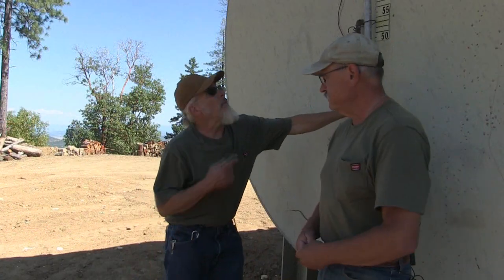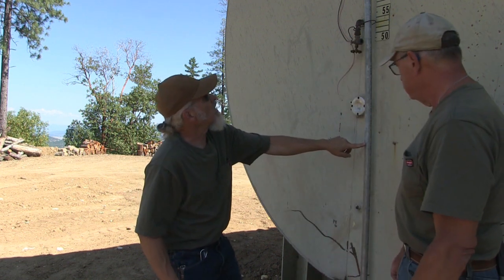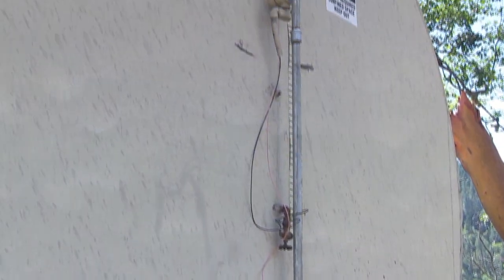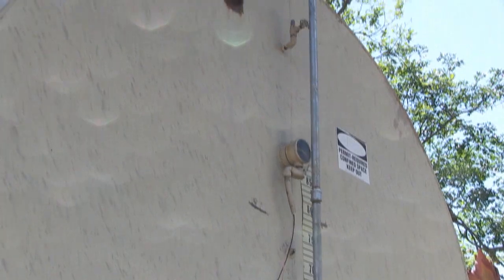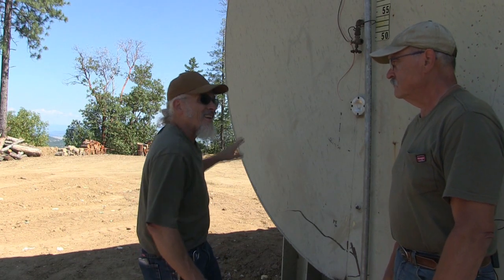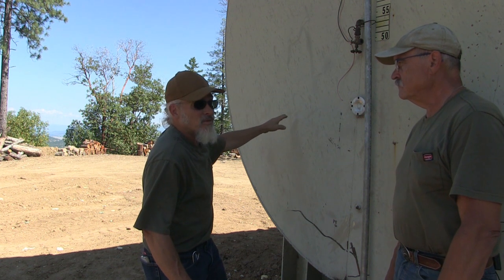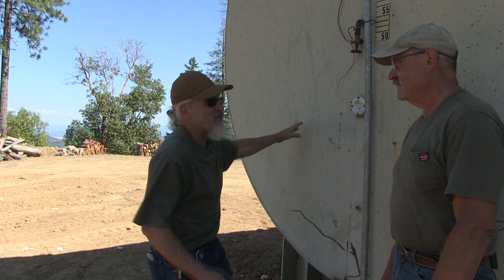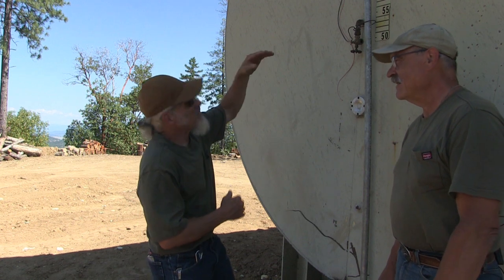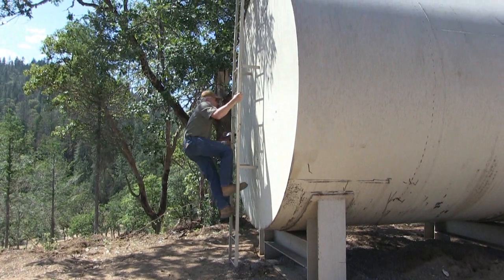So Jerry, the last part of this setup on this tank is that I have not finalized my fill line. I've got a 90 going up top, but I need a 90 inside the tank so we can start filling the tank up. The tank is mostly full right now, but I think it needs about 1500 gallons added to it, because I've been testing the line going down to all the structures. I bet that 3-inch line's probably holding about 1,000 gallons, because every time we've filled it and then realized we had a leak and drained it, the tank's gone down a foot or so. We're about 2 foot from the top right now, so I need to add some more. So I just need to get that fill line done.